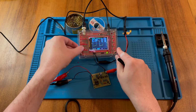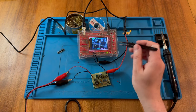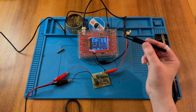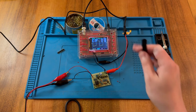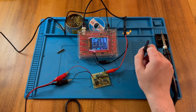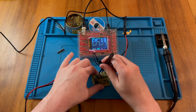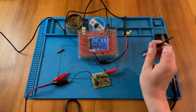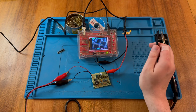And there we go. Okay, so that's at 0.1 volt. So we see we have a peak to peak of a half a volt there. And so I'm currently powering this on 6 volts. So it's interesting, I'm getting 915 or so hertz. It's a little annoying actually that this is adjusting the amplitude rather than the frequency, because I was going to use this in a project which required a particular frequency that isn't 915 hertz.